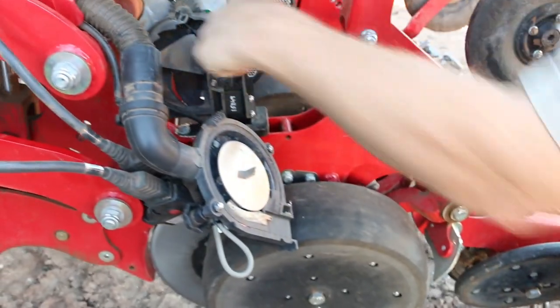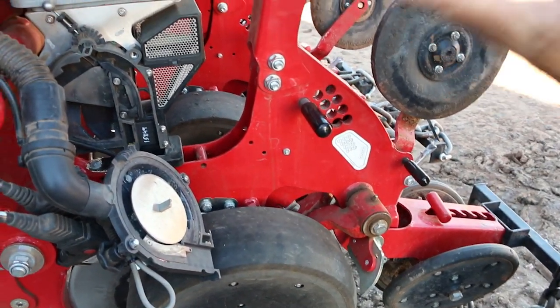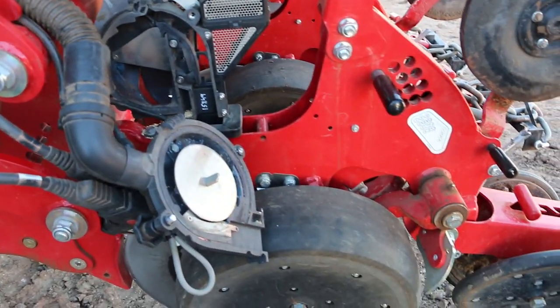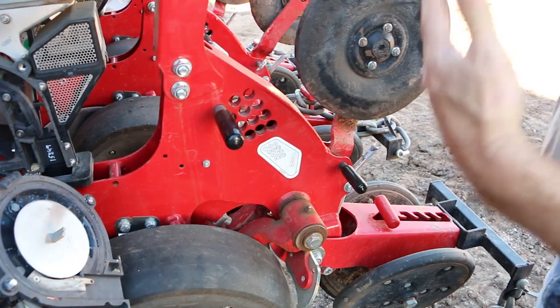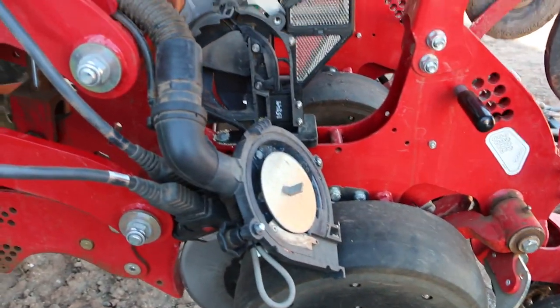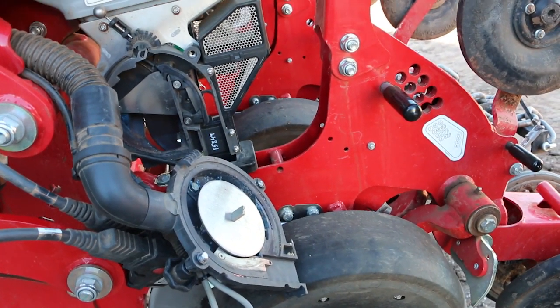But the seed sensor is down there. That's once again the brains behind the thing. It's counting seeds like cotton, so it's counting the seeds, and it knows your speed. So if there's any variation in that, it sends a signal back to the brain into this electric control unit, and it changes your rate on the go. It's very simple and works a treat.